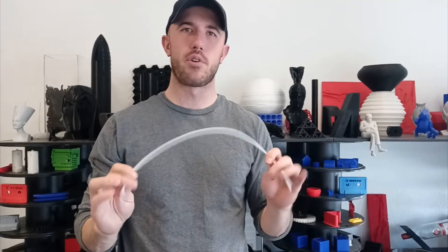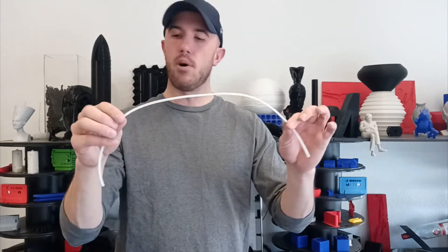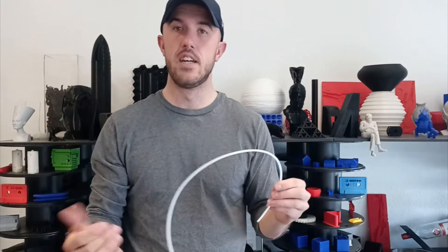So what is the challenge of working with a printer that has a Bowden cable? Bowden cables are a very common type of printer setup. Most Ultimaker printers use this, and a number of the Enders all use this. A Bowden cable machine has the drive motor at one end but the nozzle and extruder at the other. The reason it's used is because a Bowden cable keeps your extruder head light, so these machines are generally very good for high-resolution, high-surface quality parts because they don't have much vibration at the head as it's moving around while printing.